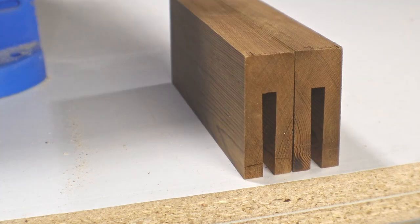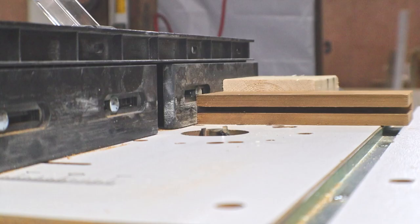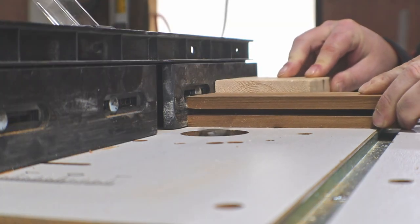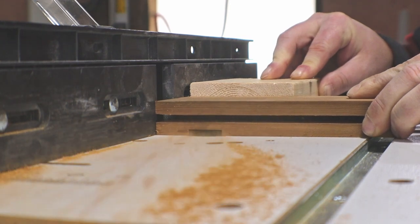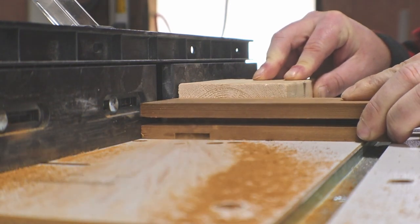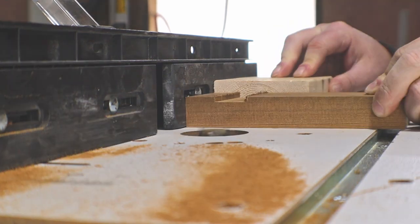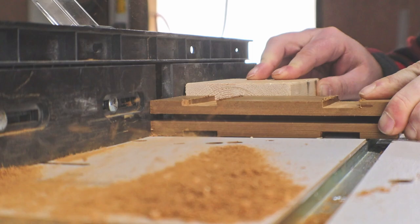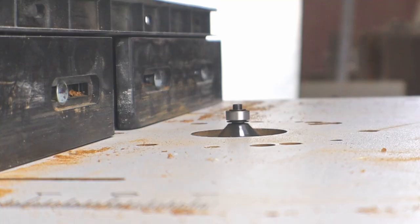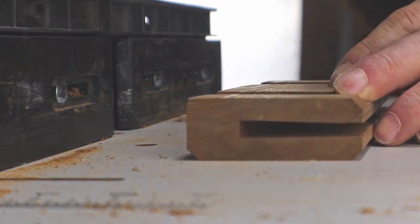I now have my four boards with a channel in each, so now I can cut some grooves for the hooks to rest in. I could probably cut these with a dado blade, but the router is easier and I happen to have a bit that is the same size as the hooks. So I used the router with a sacrificial block to try to avoid any tear out. And for a final touch, just to soften up the edges a bit, I changed to a chamfer bit and cleaned up all the boards.